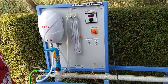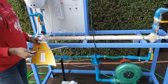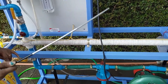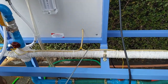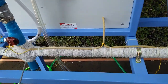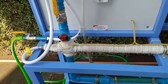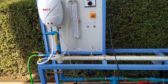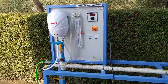This tube consists of two concentric tubes. The inner tube has fins over its outer diameter. The hot water flows through the inner tube, and the cold air flows through the space between the inner tube and the outer tube, over the fins.